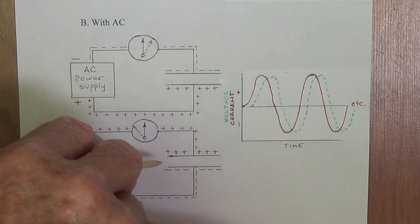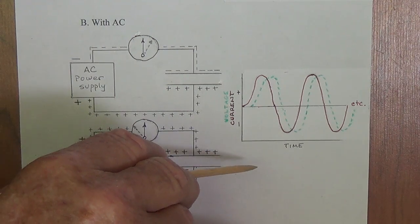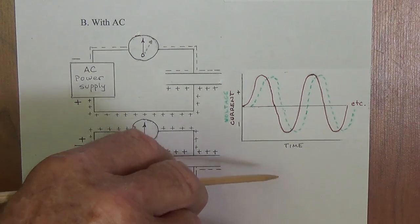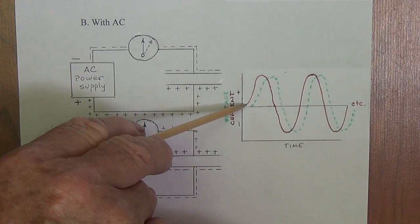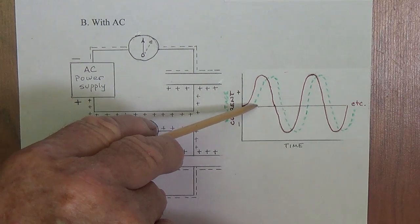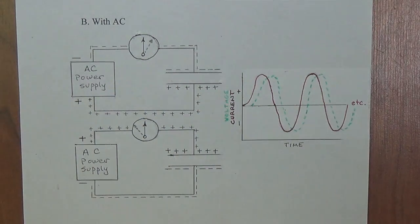Now, in my tone stack video, I go into details of where you use a capacitor and then it's followed by a resistor to ground. That's a high-pass filter. So we can adjust this lag here from 35, 45, 50 degrees dependent on the value of capacitor and resistor that we use. This is going to be very important when we develop a phase shift oscillator loop to create tremolo in our amplifiers. And I will go into detail about how we do that shortly.